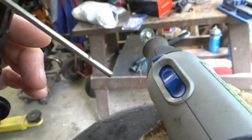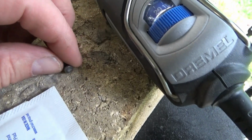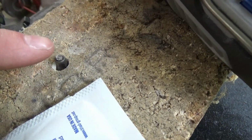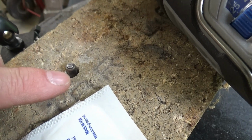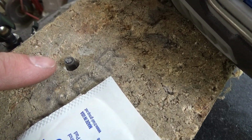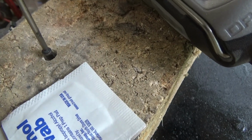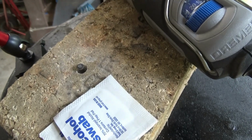You can see where it's broken. And this is the other end of the firing pin. I've got it clamped in this fixture. So I'm going to clean these up and wire brush them and degrease them. I'm going to set this piece down in the hole, and I'm going to backfill this so it won't be able to move around very well. And then I'm going to lower this down on there and silver solder the two together. Silver solder it into place.